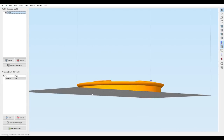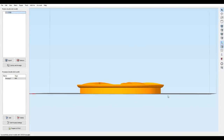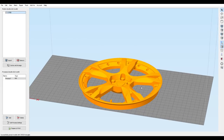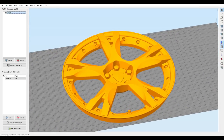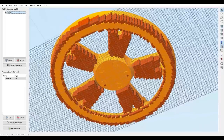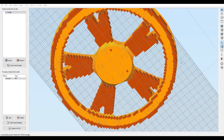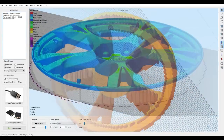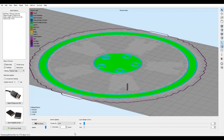The scaled model takes up most of the build volume. We had to add supports, particularly for the arches and the individual arms of the wheel. We used the automatic support system in Simplify3D, which worked really well after removing a few unnecessary pieces. Here's a quick preview of the sliced wheel — we've given it quite a decent infill so it'll be nice and sturdy.